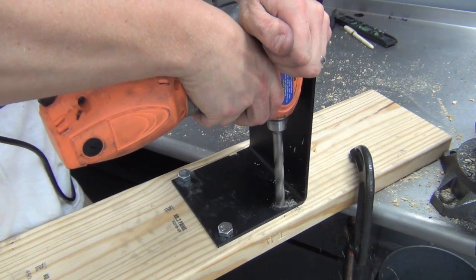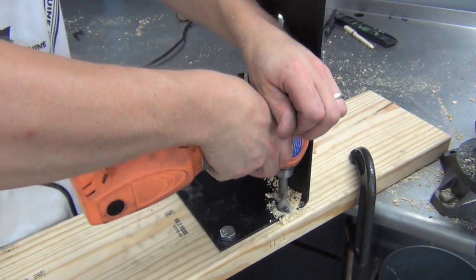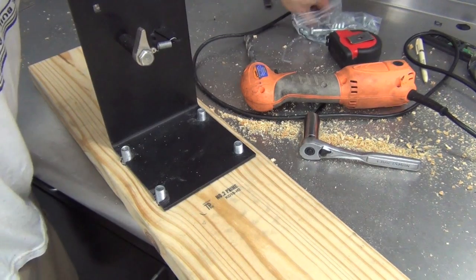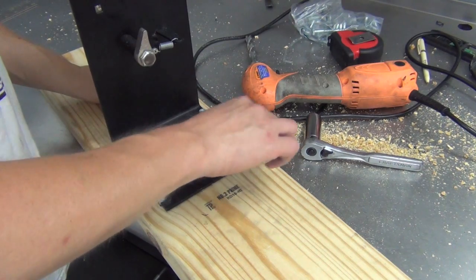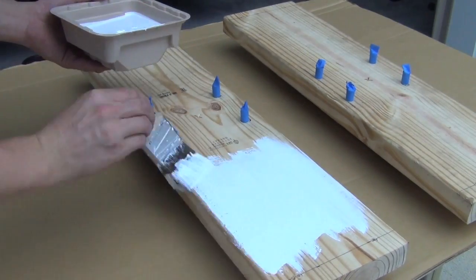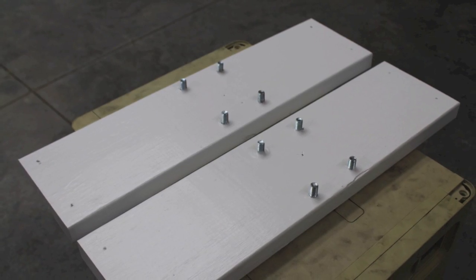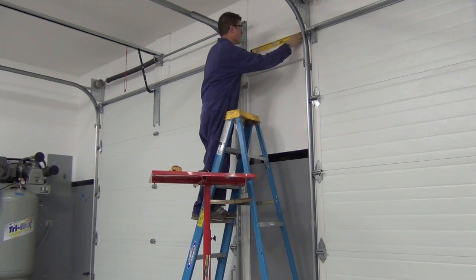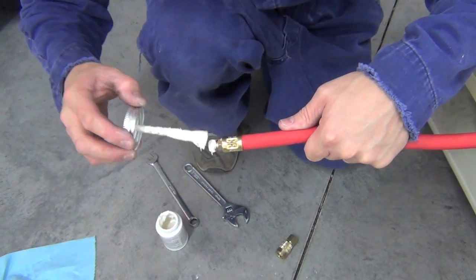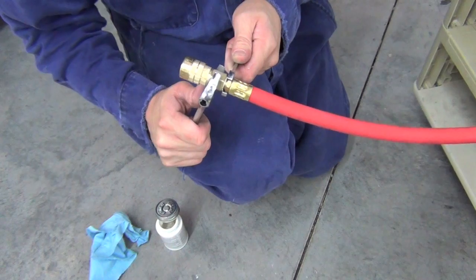Now that I had all my parts and a plan, it was time to install them so we could have air everywhere. I started with the hose reels. I began by removing the mounting bracket off the reels so I could drill a perfect template on my pieces of 2x8 lumber. On the other side of the board, I countersunk 4.5-inch hex bolts and washers that left studs protruding, allowing for easy mounting and removal of the reel. I then pre-drilled two pilot holes on either end of the board for mounting to the wall, taped up my studs, and gave each board a few coats of bright white paint. Just be sure to use some high-quality thread sealer to prevent leaks — wipe off the excess sealer and you're all done.